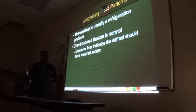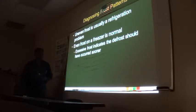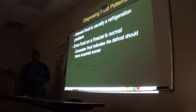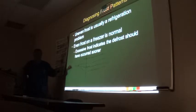No, it's just that it's even. If it's even, I'm saying, if all of them are just frosting up right up to this point, either you're low on gas or you've got a restriction in your metering device. That's what we're looking for, everything that could be possible here.